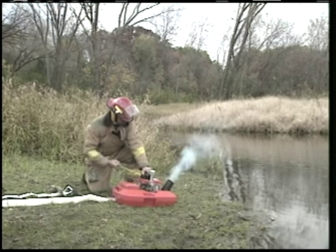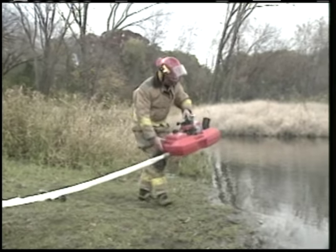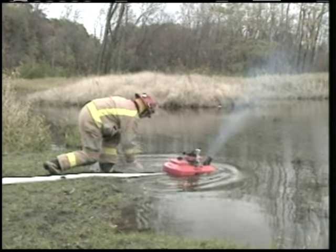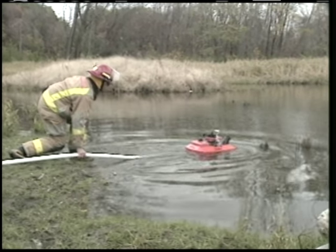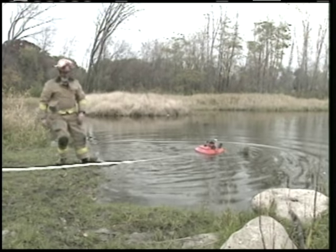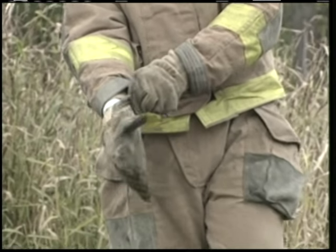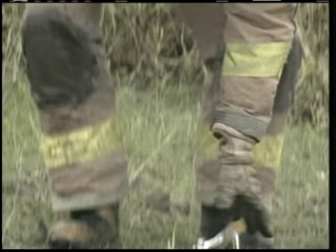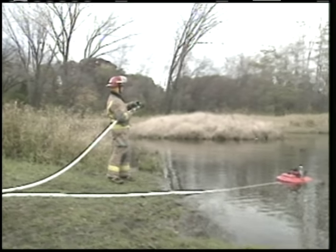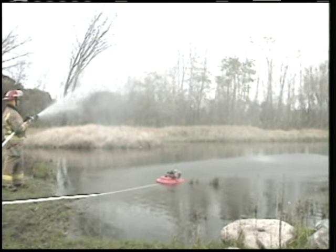Once the engine starts, lift the pump by the handle and slowly place it in the water. Do not let the Floatopump run dry — put it in the water right away. Remember, the engine heats up very quickly, so be sure to only touch the handle. Once it's in the water, your Floatopump will automatically prime itself. If the hose is partially full of water or if it's kinked near the pump discharge, priming may take 30 seconds or more. After your pump has primed, you're ready to use it for its desired application.